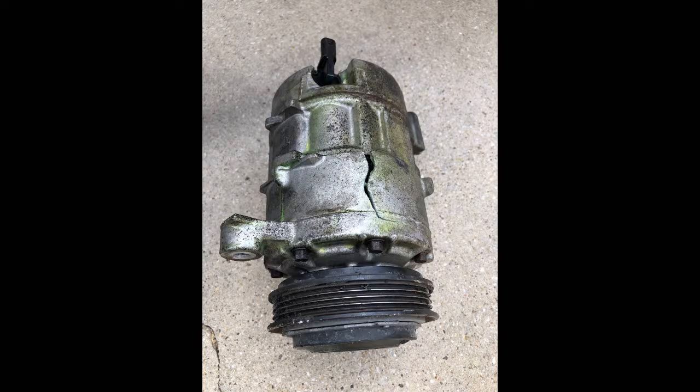We're going to look at the glass block windows today. I did some research before we got started. Last week Evan and I worked on a strange project — we replaced the air conditioning system in his 2014 Chevy pickup truck. The way it died was strange: the compressor had a big crack in it and spewed out all this oil while he was driving, leaving my house. The belt completely melted through because the pulley and compressor stopped turning. We ended up having to replace all those components. I've not talked to anybody who's had a compressor do that on a truck.